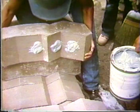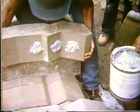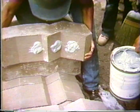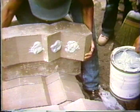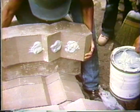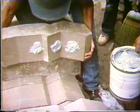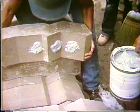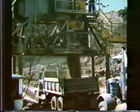One important step in all of these lightweight facing and prefabricated block systems is what is illustrated right here, and that is gluing the top course of blocks down onto the lower blocks so that the top layer is sufficiently heavy that someone in a pickup truck will not come by and stop by the wall and carry your wall away. So you do want to make the top of the wall heavy enough so that it won't be vandalized.